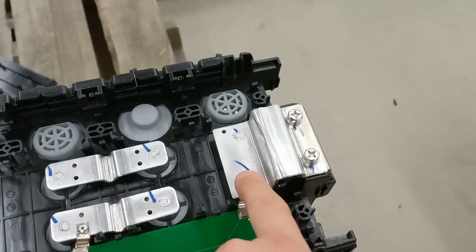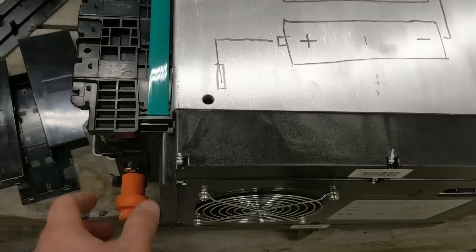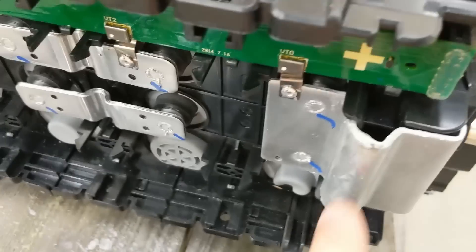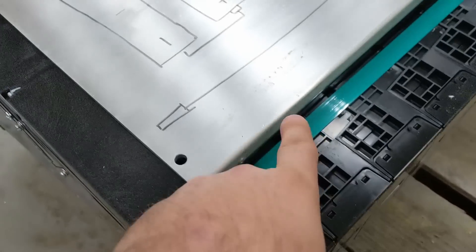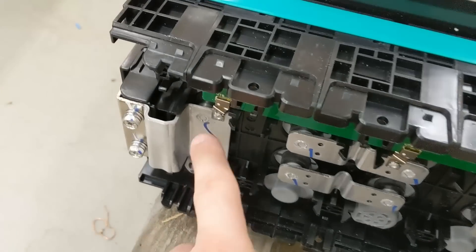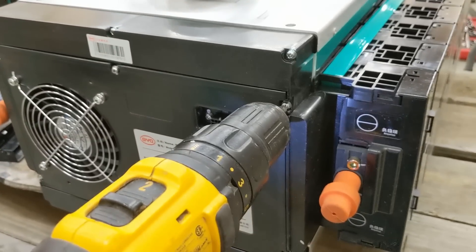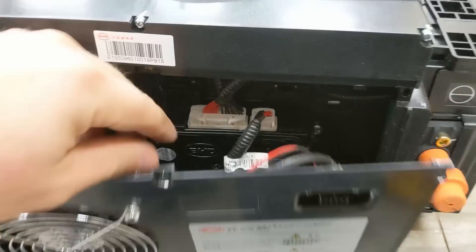You can see all the modules together. The main negative has a copper bus bar that travels down the backside and around to the front. There are eight cells in series. The main positive comes out at this post and ties to the first cell, then across the bus bar to cell two, continuing through to cell eight where the main negative is. There are six Phillips screws holding the front cover on. With the cover off, you can reach in and take the connecting pin off.